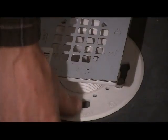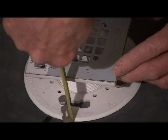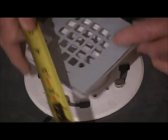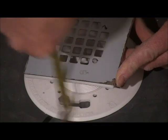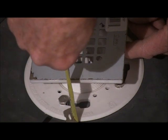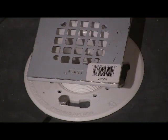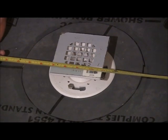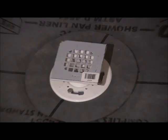I'm probably just going to measure 1 3/8 because this flange on here is probably about 1/8 of an inch thick. So we're going to screw it down until I get my 1 3/8. A little more. Just one more, maybe. Okay, we got about 1 3/8 there. So that should give us our thickness, and you can square it up to the wall. This is a square drain, so we've got 18 3/4 there, 18 3/4 there, just to make it look nice and square. And so now we're ready, once we get our line drawn all the way around,